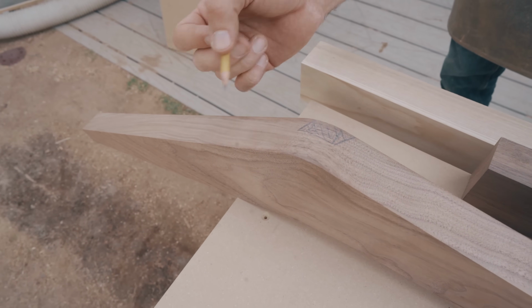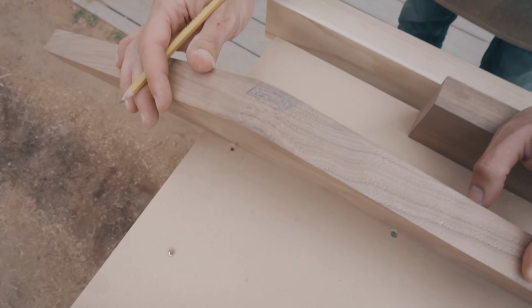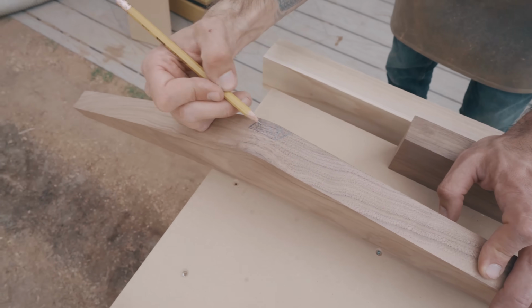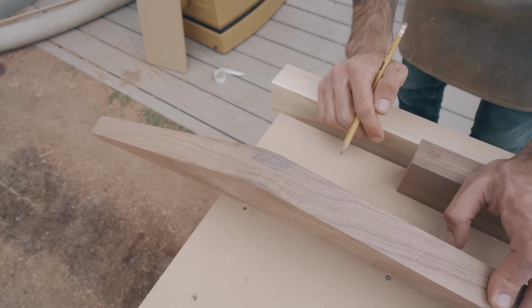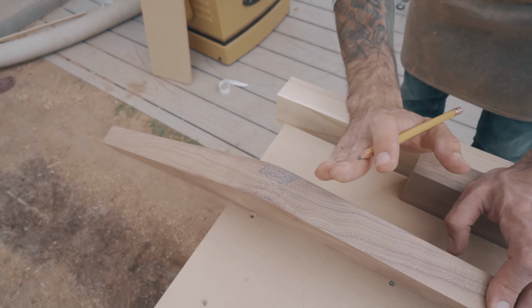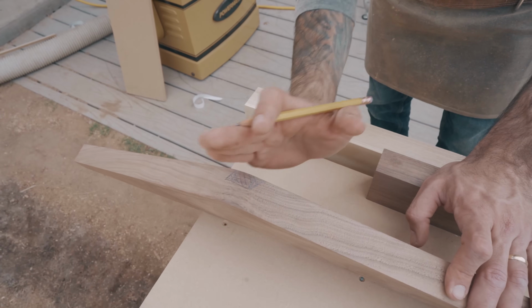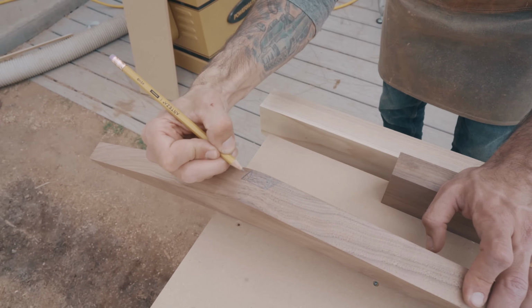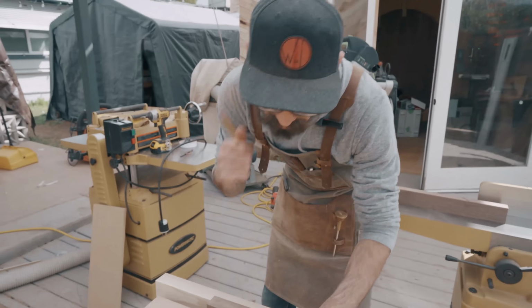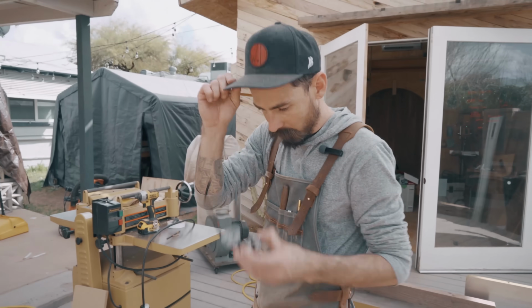I guess I should talk about that when I talk about other ways to do this. Like if you don't want to create yourself a jig, this is another way you can do it. Remove all this straight across with the router, and then come back and remove this out by hand with a hand saw and a perfectly angled 12-degree cut there, and then remove the rest with a chisel. And let us see pictures of all of your no sawdust and glue, just the real deal.